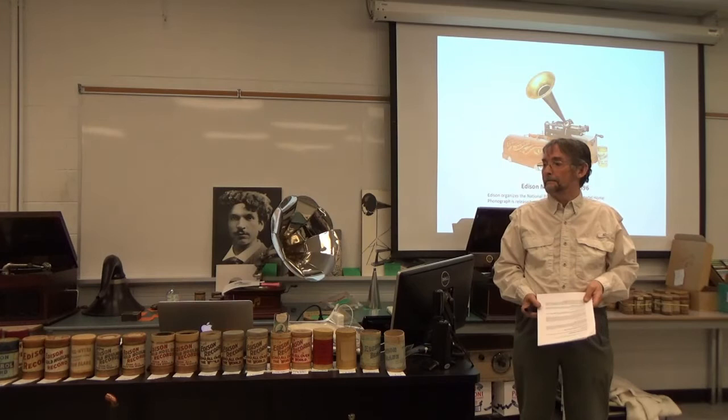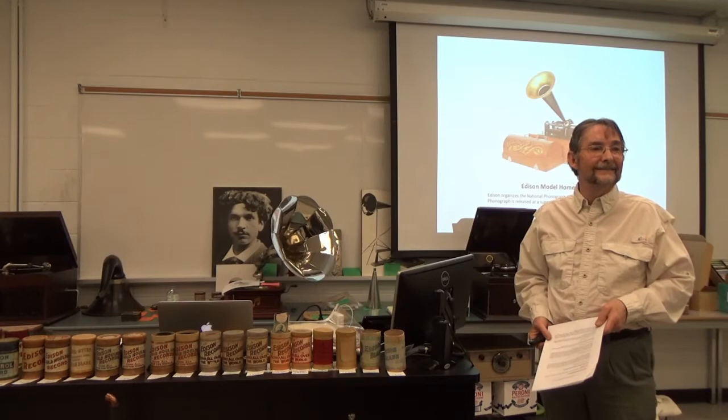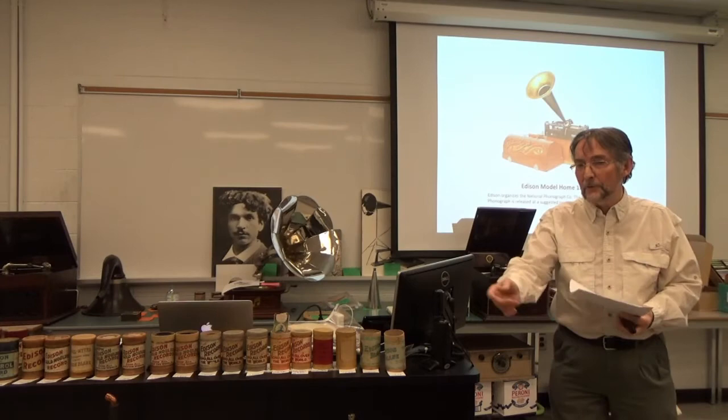But if you're going to use a metal horn, you notice how I had it bound? What's that for? That's for dampening. It's to get rid of horn resonance, and it made a big difference. If you listen to this... And show them the horn.